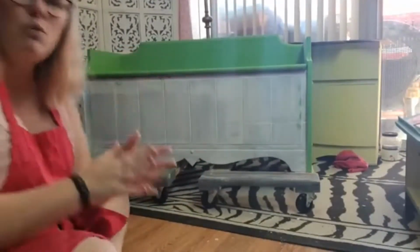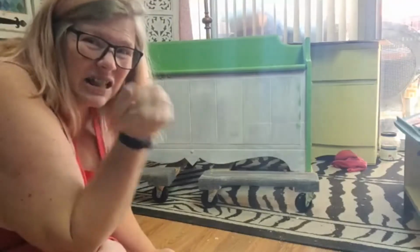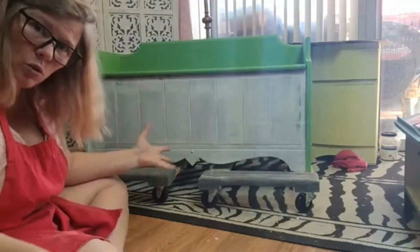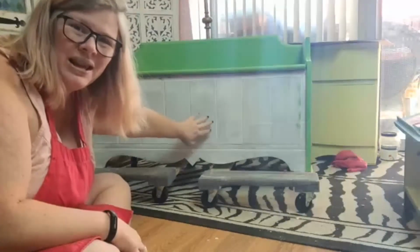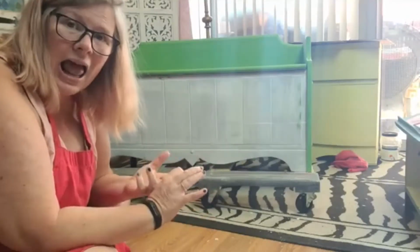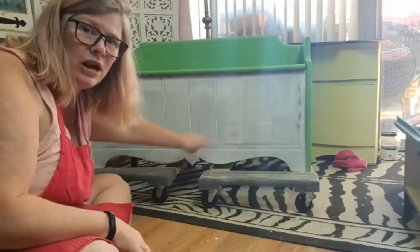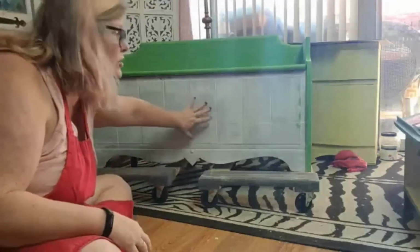So as I'm painting it, I realized let's real quick go live and show you that you can find things and change them up. I know I'm going to be in the way a little bit, but I've already painted the top. This was real wood, but it's that 70s wood that's not so popular with veneer. After he repaired all the cracks and the wood missing and got it to one piece again, this is a coat of Boss, B-O-S-S by Dixie Belle. It's basically a primer to block odors, stains, and smells. It comes in white, and that's Boss there. So the natural wood veneer got painted with Boss. I let it dry overnight after Jason had repaired it. So it's been like 2 days curing, then another day of curing with Boss.